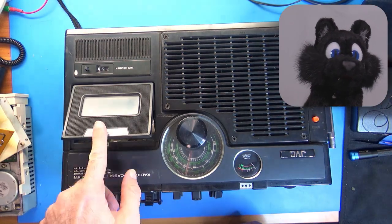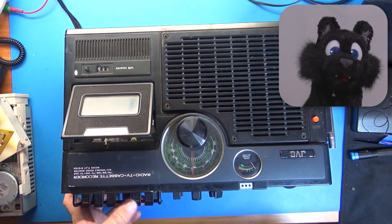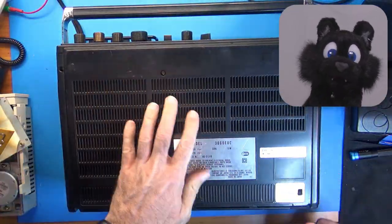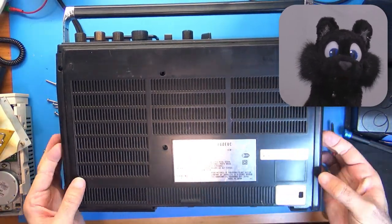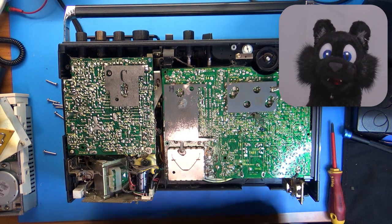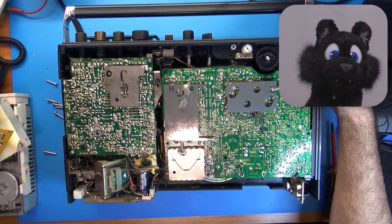The disassembly is of course first again. And, like usual, I try to take out every last screw so I can address any rust, dust or busted part. In this case, I'm going to replace the drive belt and all the electrolytic capacitors. Why is everybody replacing these capacitors? Well, you can see my informational tidbit video about that.